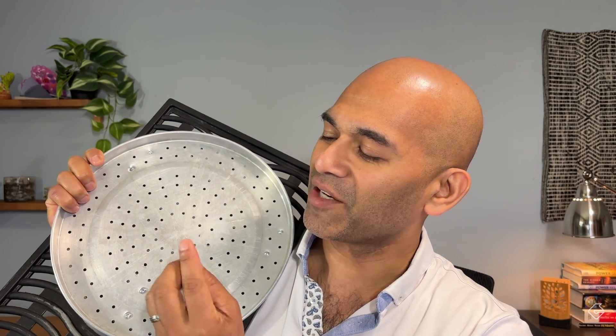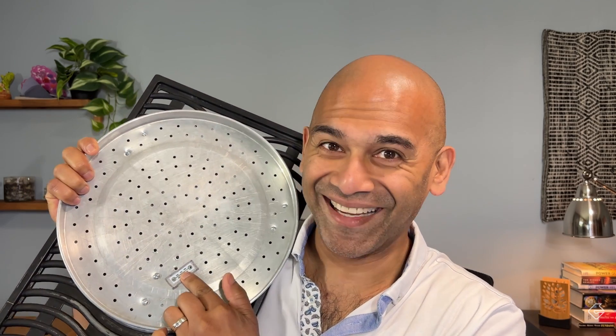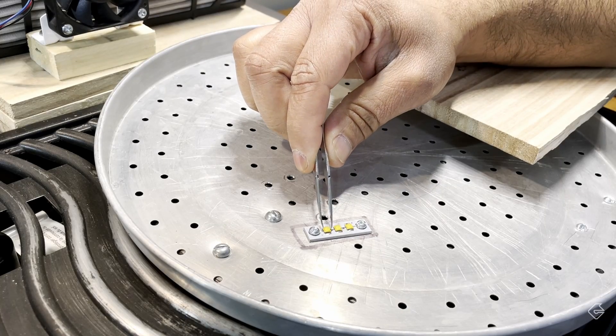It was a complete coincidence, but the way I designed these PCBs, they've got two little holes that are used to clamp them to whatever luminaire they'll be attached to — which also serves as a heat sink. And it just happened that the holes lined up perfectly with the pizza pan perforation — a match made in heaven. I attached this to this, plugged it in, waited for it to heat up, and it actually worked. I was able to solder three LEDs to this printed circuit board without any injuries.